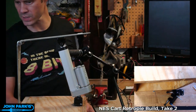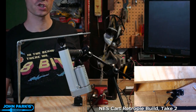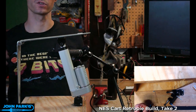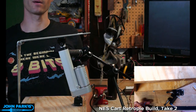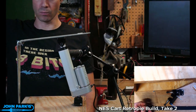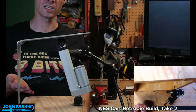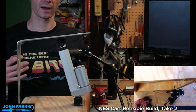Someone was asking earlier about the range on some of the packet radio projects. I'm not using the LoRa ones. Those are ridiculous and overkill for what I need, like 2 kilometers or something they can do, or more if you tune awesome antennas. I'm using the other ones, the RFM69HCWs, and I'm easily getting stuff 500 yards away for the types of commands. It's really low bandwidth, so it's just little messages. Like when I'm doing this RFID stuff, it's just, yes, this was the answer we're looking for, for this chess problem thing that I'm working on.